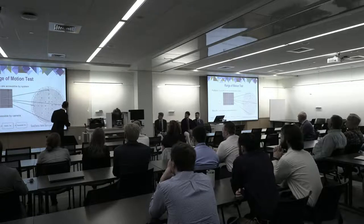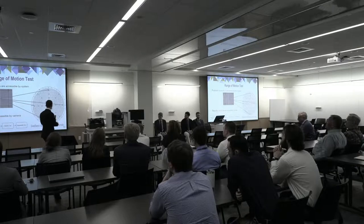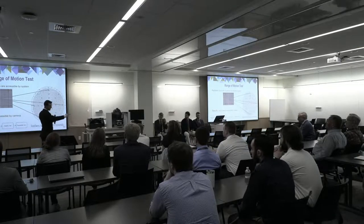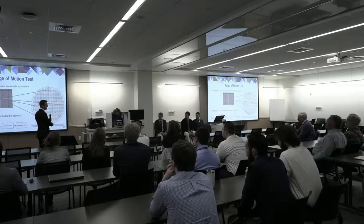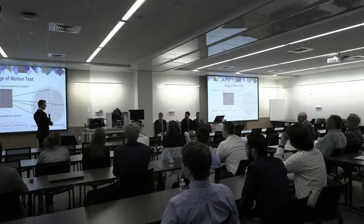So we jogged to this value to get our absolute calibration values. Now, when we do a full scan, we set the grid in like it is shown here, and then we center this first point. We then move to this point here, and we manually enter that. That's our second form of calibration. From these two values, it maps every single pore.